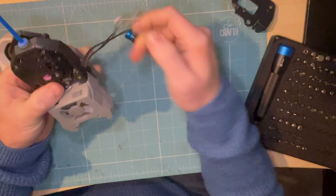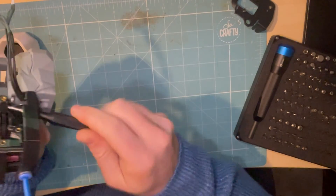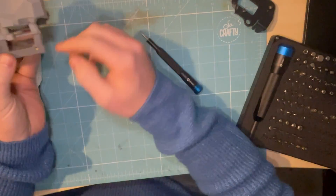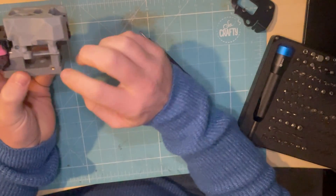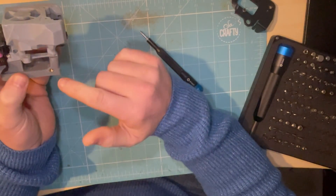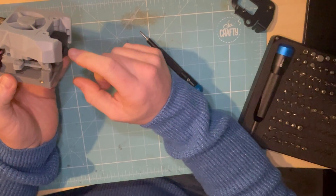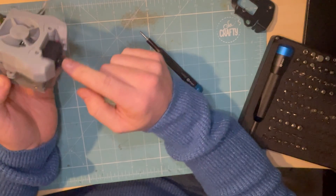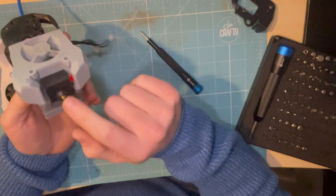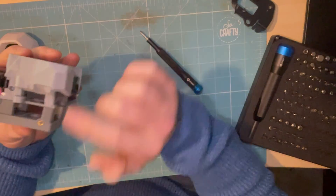You now have all of the fundamentally required parts for your Stealthburner fitted. Your inductive probe will screw in the side here. On my Printables page for this bracket, I've already got the X and Y offsets for the probe to the nozzle. That was based on using a Bambu Lab nozzle, not a V6, but I think they're generally all the same. This nozzle generally winds up exactly centre to the extruder, so those measurements should be the same.